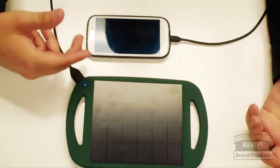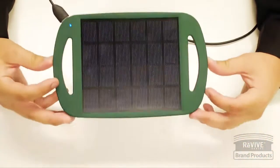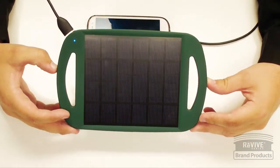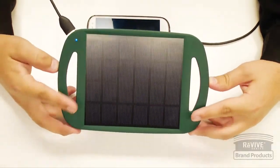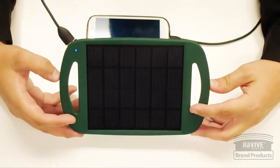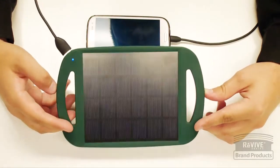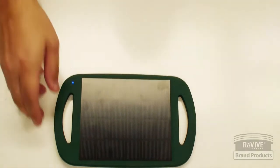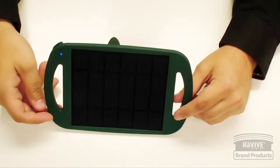For example, the Galaxy S3 has a 2100mAh internal battery. The Solar Restore Panel 360 outputs at 360 milliamps per hour. So if your phone is at 5% charge, take 2100 divided by 360 and that's the approximate hours it will take to recharge that 2100mAh battery to full.